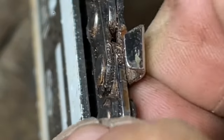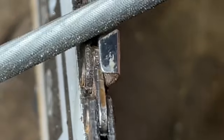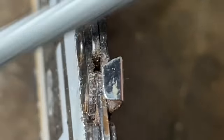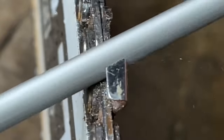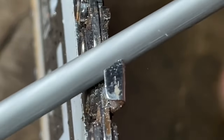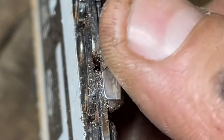Look at that thing, friends — completely ragged. See it? Trying to get the light to flash on it but you can see it. Put the file in and it'll really show up. Look at that whole front edge — completely ragged. What is it supposed to look like? Now because it's the first filing we don't have to get too aggressive with our down pressure. We need to clean this top edge up. See it — we're not even creating that much of a burr, we're getting it clean. It's not done yet, not to my liking. See that mess cleaning up? I'm doing a whole pile of strokes because I want it sharp. See there — I just got rid of the burr.